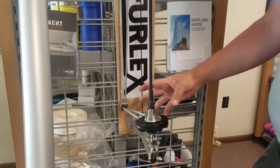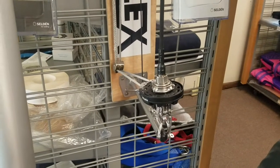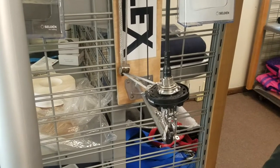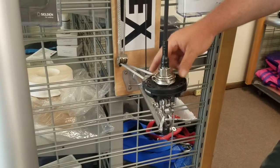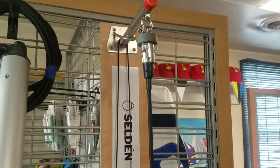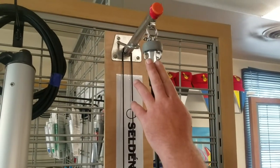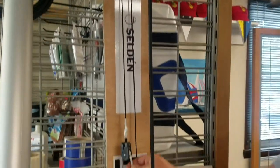Part of the way these furlers work — it's known as a top-down furler. So the head of the spinnaker would attach at the very top. The tack actually spins on this. So as the head is attached here and we pull our continuous line, it starts wrapping from the top, going all the way down until we get to the tack.